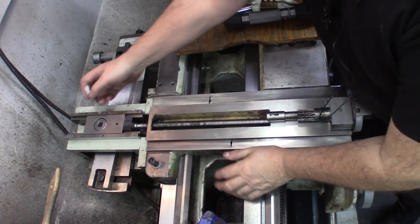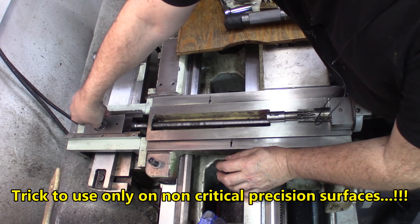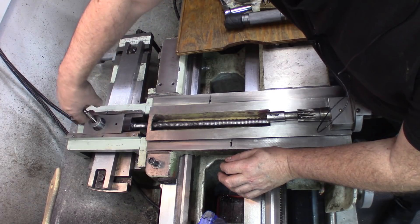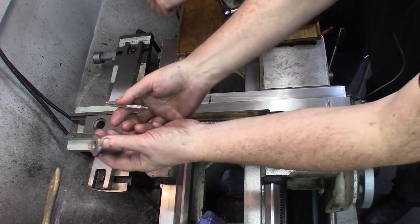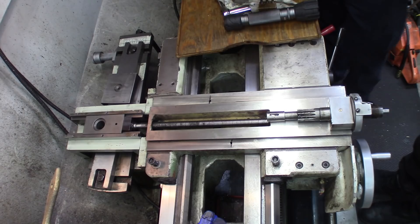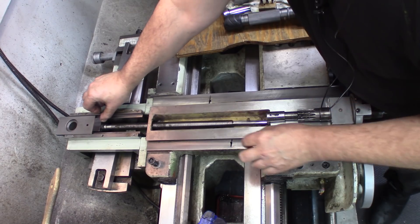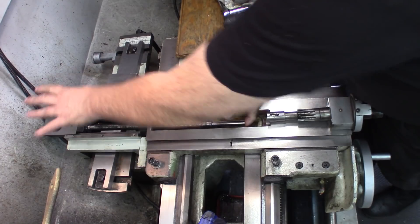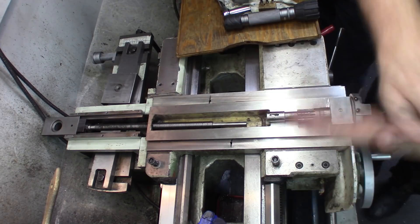The bushing here — I'm using a tapered tap like this because sometimes you might have a few problems moving it out of the bushing in here. I just get it in there a little bit and engage very lightly a tapered tap — easier to pull it out. Because there's no slack in there; it's a pretty slight fit. Also, next part of this, if you come in the front — the other business end of this deal — I could remove it there but I'd have to remove the backing, and I'm not moving out the whole shop for that.